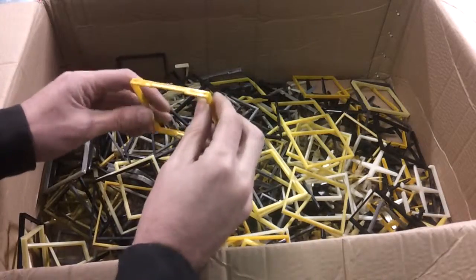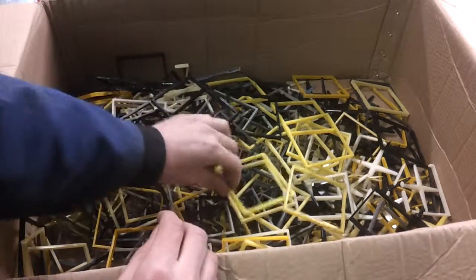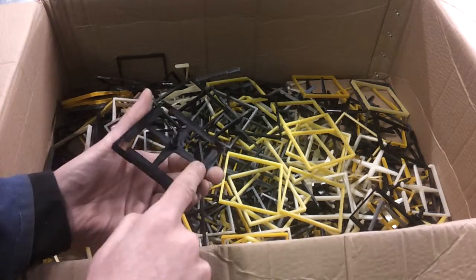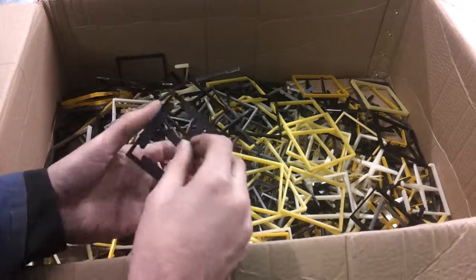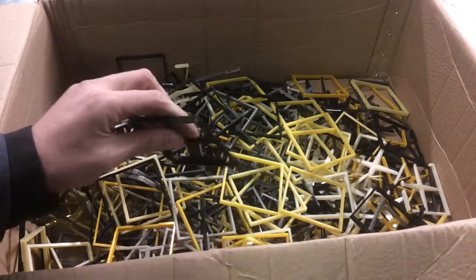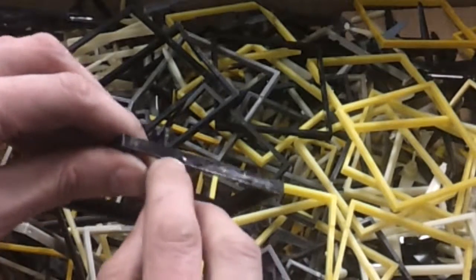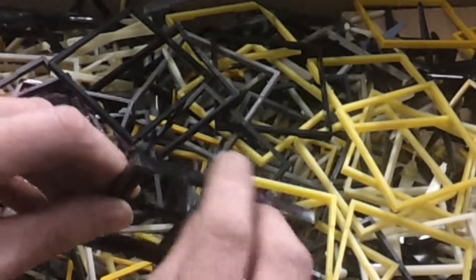A few hours later and all I seem to have done is mould scrap — I'm still getting horrible sink marks down the edges here. I've tried different ABSs and different master batches to see if that would make any difference but sadly it didn't. In desperation I decided I was going to re-cut the thing and add some extra runners to the side of the frame — instead of filling at a point and jetting out along the side edges, extending the runner should fill more consistently all around. This didn't make an enormous difference, but swapping to nylon did — I was getting reasonably good edges in nylon. But the problem with nylon is some marking along the edges, still a bit of pitting, and quite a lot of spray down one side — I couldn't quite get rid of that.